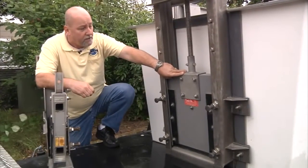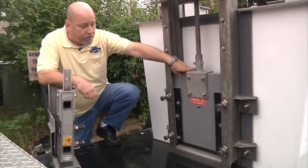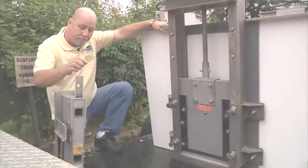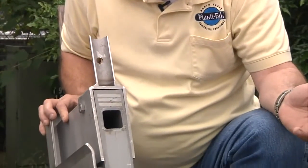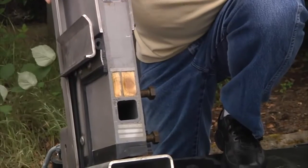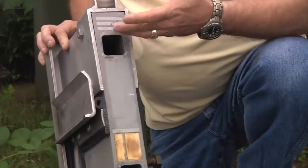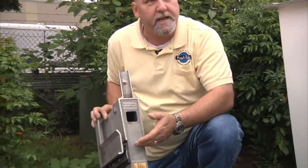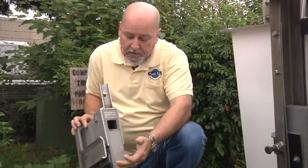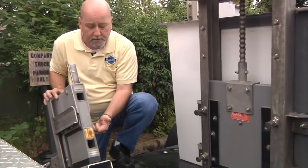The seals are out of the way and out of the jump. I'm going to show you a little bit how the gate is manufactured, and then we'll go into demonstrating how well the gate seals. As you can see, there's no water coming in or out of the gate itself right now, and the box actually is full of water. This is a cutaway of our heavy-duty sluice gate or tight-sealing gate. According to AWWA, allowable leakage rate for sluice gates is 0.10 gallons per minute, whether it's seating or unseating head. We put the seals on the gate itself, which is easy for replacement and maintenance. Now you no longer have to go down in the hole, send somebody down there, harness them up, meet your OSHA requirements, and have them go down and scrape and clean the seals out of the guide frame. They can actually lift the gate up, pull four bolts off the top of the head rail, bring this back to the shop, lay it down on the table, and go ahead and replace the seals.